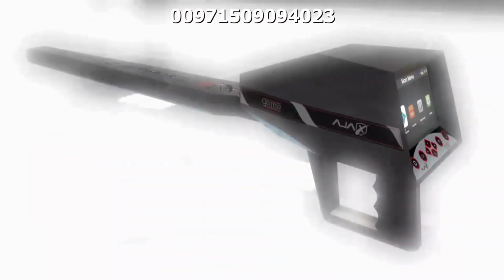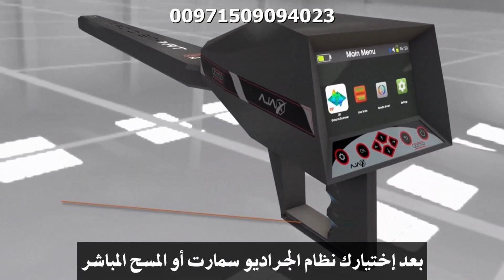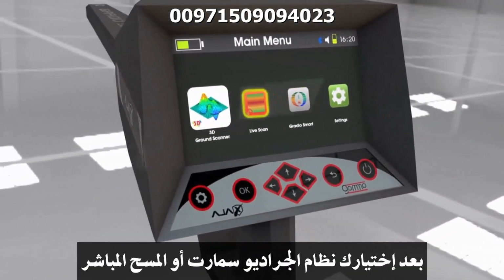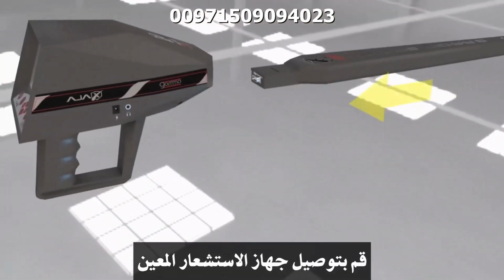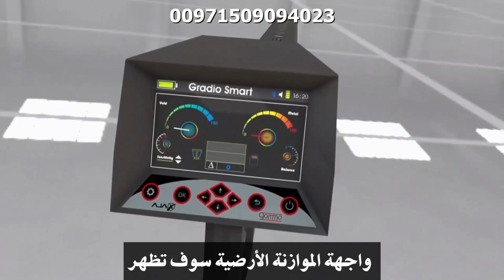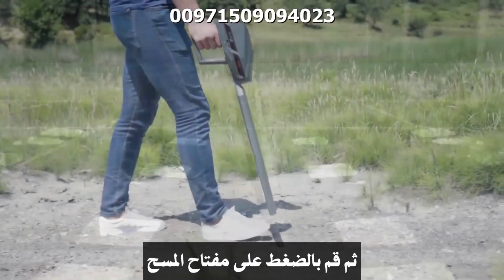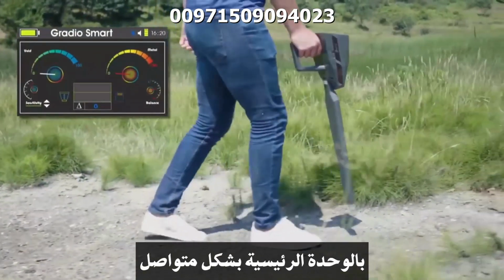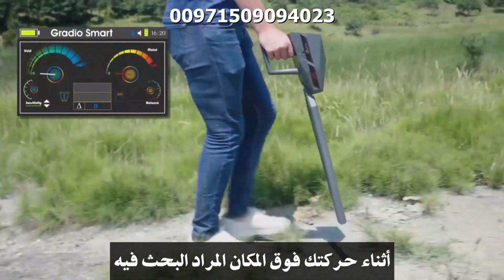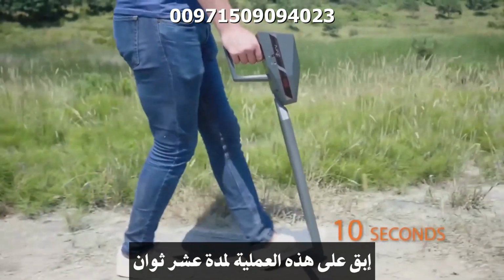Ground balancing. Ground balancing the GradioSmart sensor. After choosing GradioSmart or live scan system, connect the designated sensor into the device main unit. The ground balance interface will show. Point the device towards the ground vertically and press the grip key in the main unit constantly while moving over the search location. Keep this process for 10 seconds.